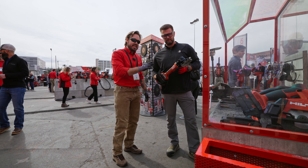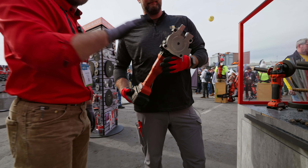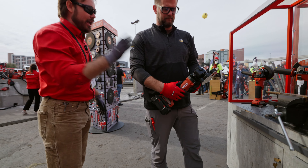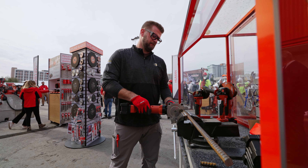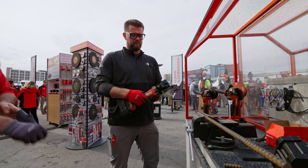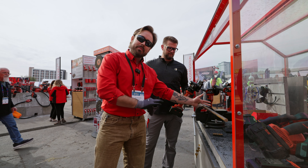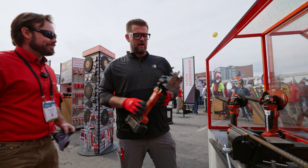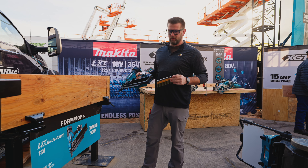Here's the NRC622 — the Nuron flush-cut rebar cutter. It uses the same blade as our structural steel blades and delivers a low-to-no-spark cold cut. This lets you get onto your material and start working without worrying about burns or fire watch. It's a tool every concrete guy is going to want, and it's flush cut.